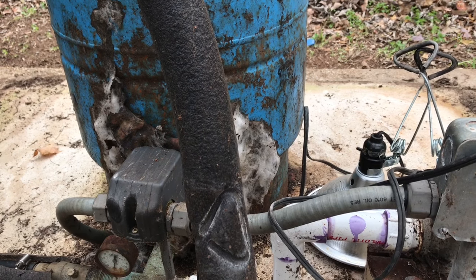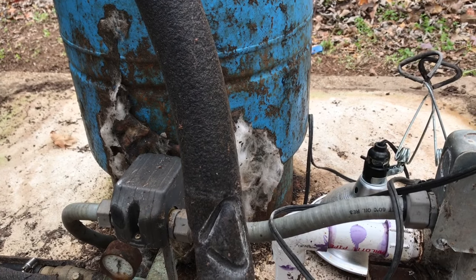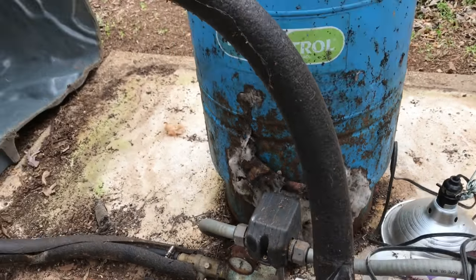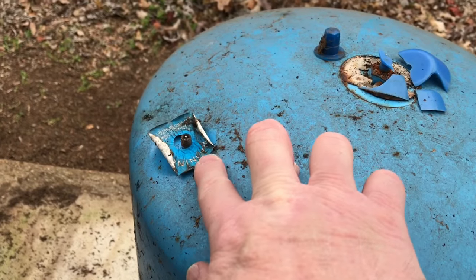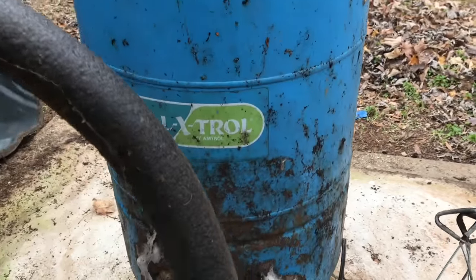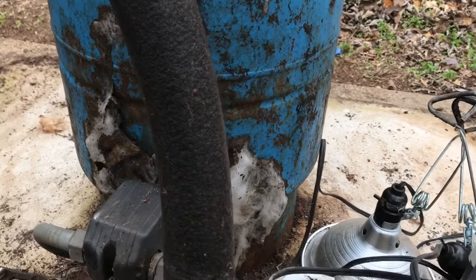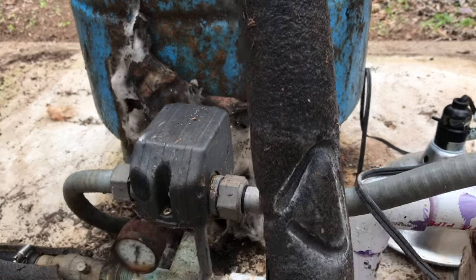Water pressure has been erratic — going up and down. You can be in the shower and the pressure is really good and all of a sudden it kind of drops and comes back in again. So I decided to come out here and do a little investigating, and what I found is I put a pressure gauge up here on my tank and it only had about 10 pounds of pressure. I do know this tank is about 22 years old, I've never replaced it. I've actually put two well pumps in this thing and I probably should have replaced the tank the second time, but me being a hard head I didn't, and now I've got another problem.